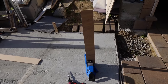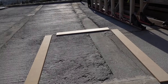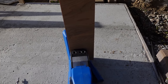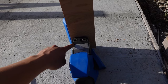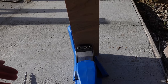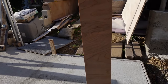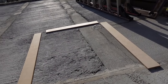Back to framing the bump out — my plan is to build the box, see how it fits, and then take off some of the depth using a router. Since I don't exactly know the depth I need at the end, I'm skewing my pocket holes to one side so that if I need to trim some off, it won't cut into a screw or pocket hole. Then I can just run over it with a router flush cut. Hopefully this is the ideal way to do it.